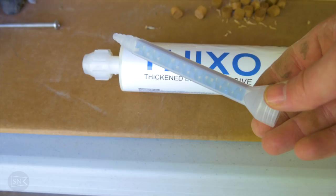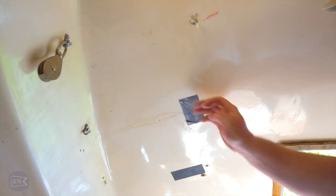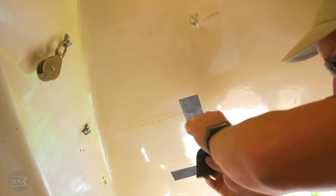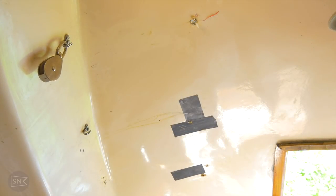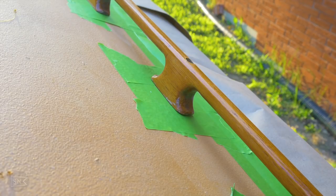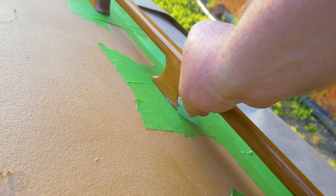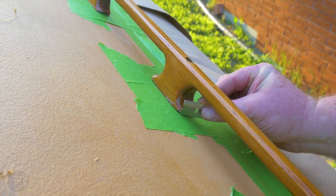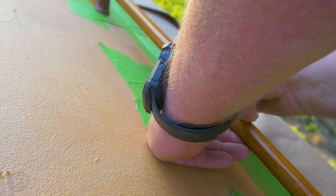The next step in prep was to place tape under the holes for the new bolts. I used a special kind of tape from filmmaking called gaffer's tape, since it sticks extremely well to just about everything — it's very strong yet comes off easily and doesn't leave any adhesive behind. I placed a small hole for the bolts to punch through the tape once they were inserted, then went back up top. I then painstakingly made masking cutouts for each section that comes in contact with the deck so that the handrails would seal to the deck underneath but any squeeze-out of the Thixo would not spread out all over the rest of the deck. This was probably the most tedious part of the job.